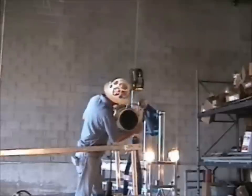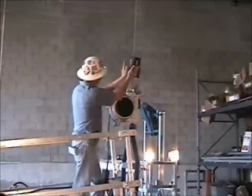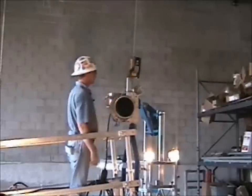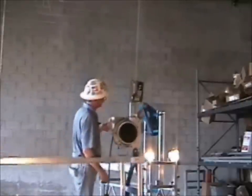So I'm going to check this right now — it's coming out at the same rate. Just going up a couple of inches to spread those jaws apart. Now I can take this handle and very easily turn it in a counterclockwise position. The hoist will now operate in the up and down direction.